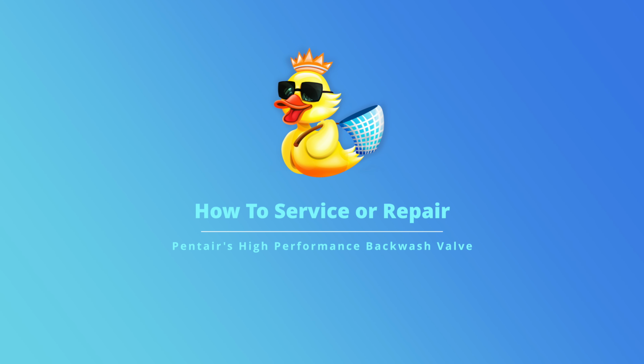Now we're gonna go down here. This is the backwash one. We're going to take this off. Now notice here, there's a little notch right here, and there's a notch down here in this, so that's how you orientate it when you go to put it back together. We're gonna go ahead and clean this off. O-ring's still in good shape.